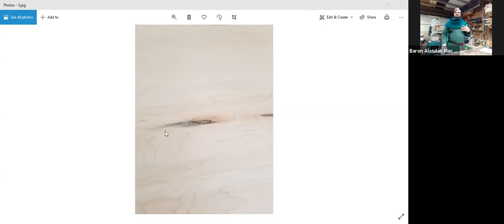The actual makeup of the plywood is different layers of wood glued perpendicular to each other to make up the thickness. The top and bottom faces you'll actually see are usually very thin, especially on your higher-end hardwood plywood — you've got to be really careful not to sand through it accidentally. You want something that doesn't have a lot of marks or blemishes. There's a darker area in this picture that looks like it's from a bark inclusion or where a branch was connected. If you're going to put a dark stain on it, it probably won't show up much at all.